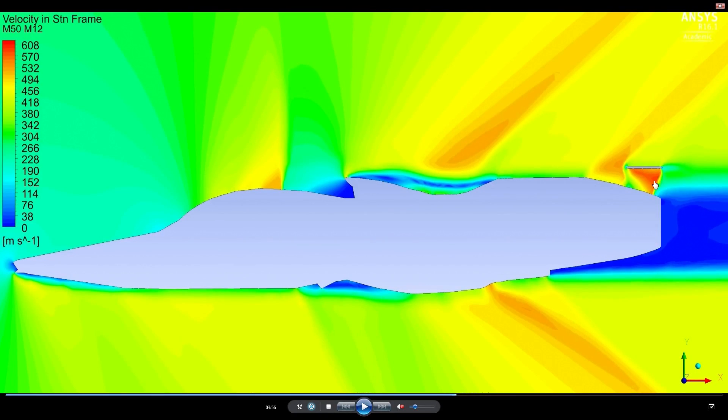There's a lot of acceleration going on here because this is a 2D model — the mass coming in has to speed up to fit through a smaller area, the same way a converging nozzle works. We're also having a shock at the nozzle, which is really cool. We have high pressure zones at several locations because velocity is zero there — low velocity equals high pressure. The area down here near the landing struts is causing a lot of problems and would make this aerospace engineer very happy if it were removed or smoothed out.